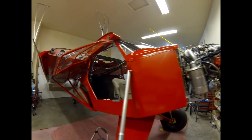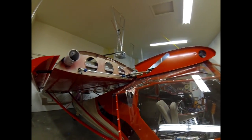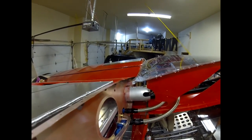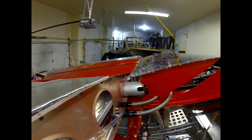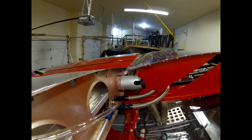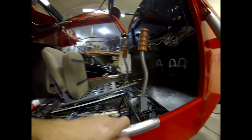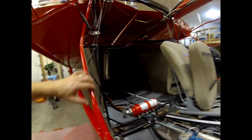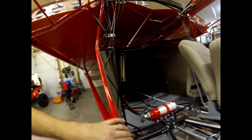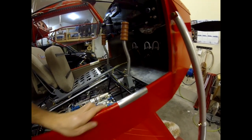This is the other side of the airplane — same hookup, same everything, just no temperature probe. At the top corner where the wing meets you need to cut your Lexan at about a 45-degree angle because it'll foul when the wings fold. I did about a one-inch cut at 45 degrees and it just clears. I also added the plate here that everybody does, but it keeps peeling back no matter how much contact cement I use. I think I'll do a bent piece of aluminum angle for that whole area — I know guys have done it and it looks really good.